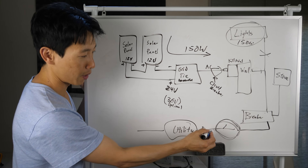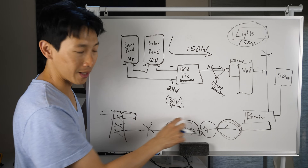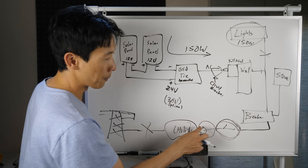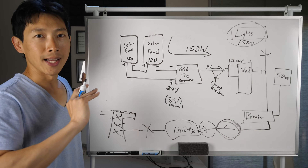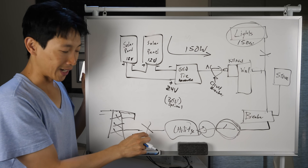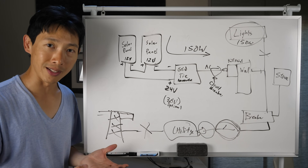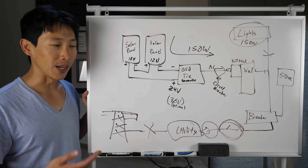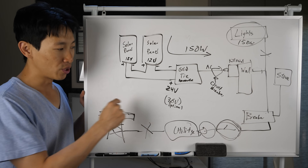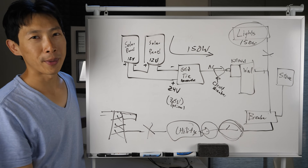So what happens if the utility workers want to work on the wiring over here? They cut the electricity over here and think all of this is not live. But the grid tie inverter goes — hey, there's no 110 volt voltage coming in all the way here — therefore it goes, okay, the power is turned off, so we're not going to push any power back out. Therefore the utility workers cutting power here are safe, if you use a grid tie inverter that has this feature — and the one I use that I've tested does have this feature. Thanks for watching everybody. I hope this was helpful. If you guys are interested in the products I use, I'll leave a link down in the video description below. If you want to grid tie to your utility companies, you actually need a contract with them. Thanks for watching everybody — don't forget to give me a like, comment down below, push that subscribe button and ring that bell icon. Thanks for watching.